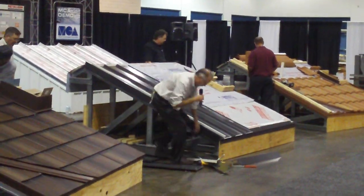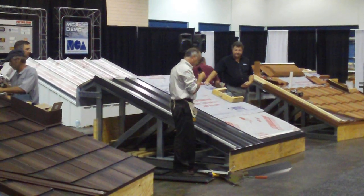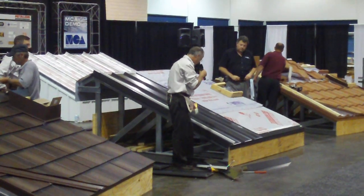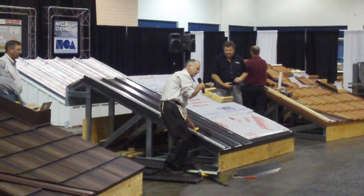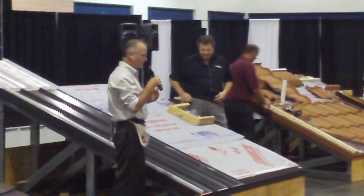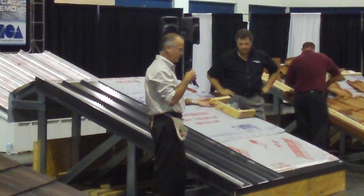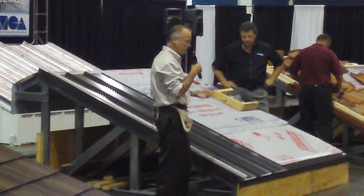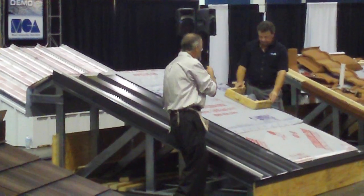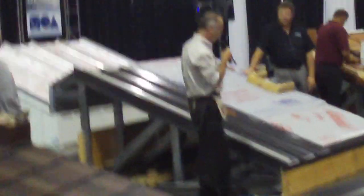But one thing I like to do is check. Unfortunately, I'm in sales but also involved in the technical side. I have to get called out on jobs. Somebody's having a leak problem. Why is it leaking? One of the first things I do, I just take a little spatula and go around all my perimeter zones to make sure they have this butyl material between these two different mating parts of metal. A rule of thumb I use: anytime you have metals that are in contact with each other, they should be separated with some of this butyl tape material. I just make sure my little spatula doesn't go through. So that's my first thing I look at whenever I go out on those so-called problem jobs.